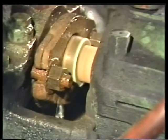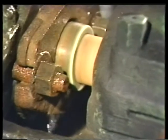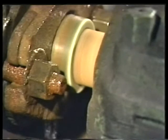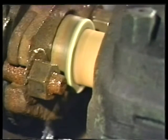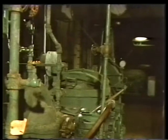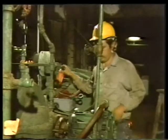When a pump is leaking as much as this one is, you know that something's wrong. If tightening the gland follower doesn't help, and water keeps pouring out of the gland, the pump probably needs repacking. The first step in repacking is to have the pump shut down and tagged out. Next, get together all the tools you'll need and take them with you to the work site.